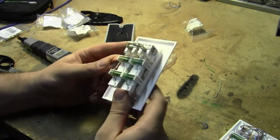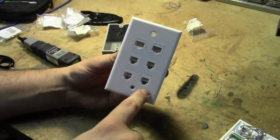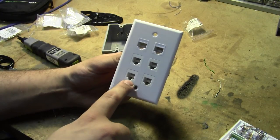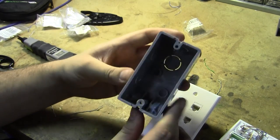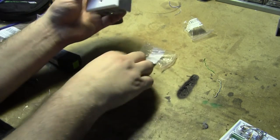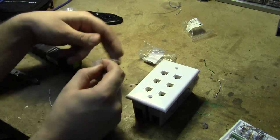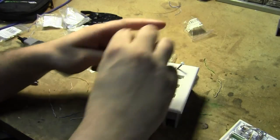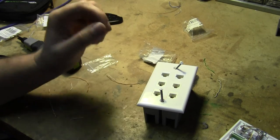Alright, so there's our four ports. Your two trunk lines up here are completely mirrored, and ports one through four are breaking out the center pair, the left pair, the straddled pair, and the right pair. I just took the plainest 12 cubic inch gang box I could find — this just fits in there — and the face plate comes with a pair of screws, one on the top and one on the bottom. And we've got a finished breakout box.